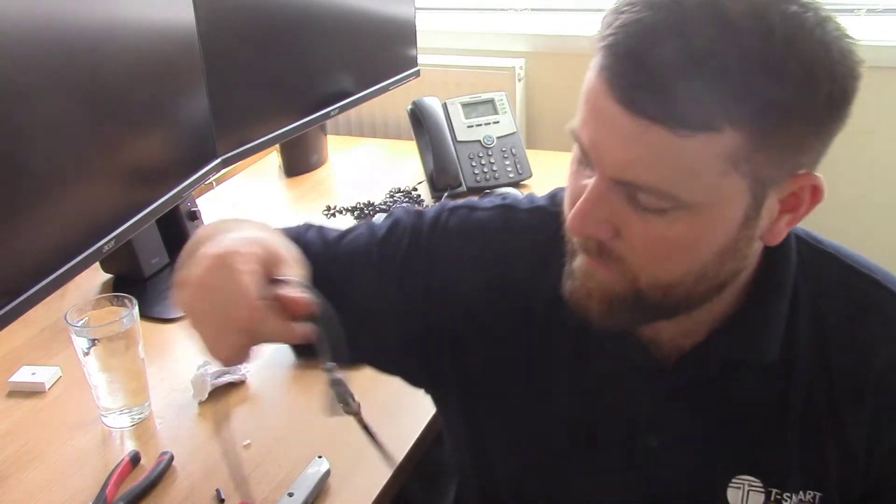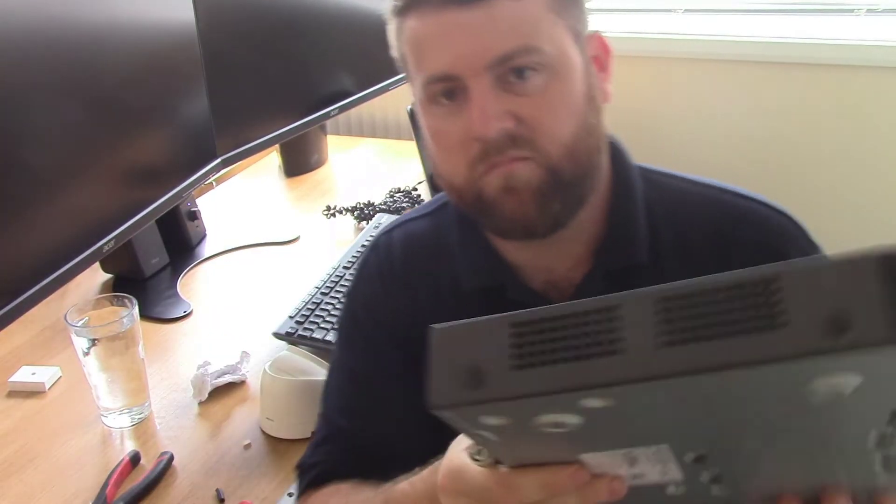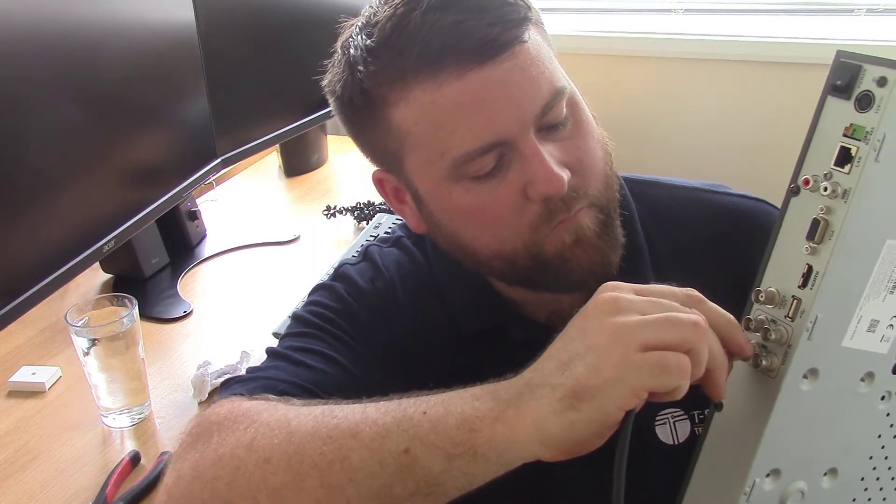But usually with most sort of CCTV systems, you'll be putting separate terminations in for your DC and a separate power supply at the DVR end to power the cameras. So let's go into our DVR — which is just a Hikvision standard unit — pick the right input, camera one, screw in there, and that's ready to go.